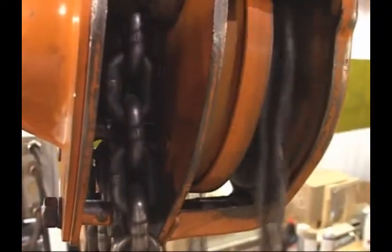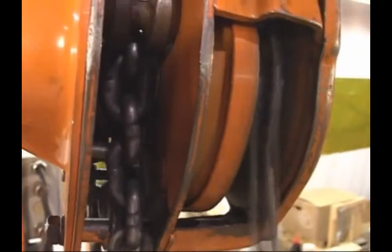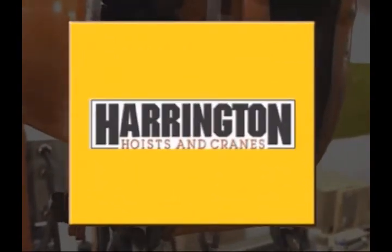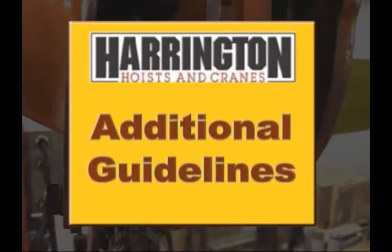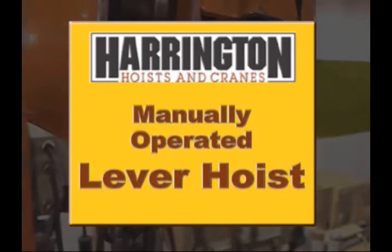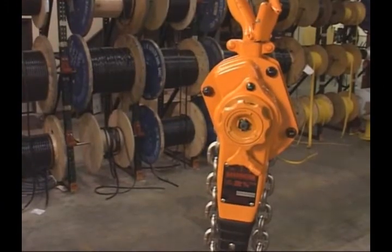Whether manual or powered, hoists offer plenty of advantages, so always play it safe by keeping these guidelines in mind. Now you have heard the general guidelines for hoist inspection, operation, and maintenance. But don't leave yet. There are some additional hoist-specific safety guidelines you need to know. For a manually operated lever hoist, do the inspection without a load.